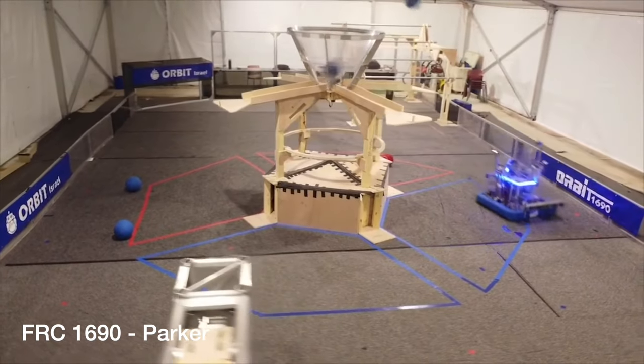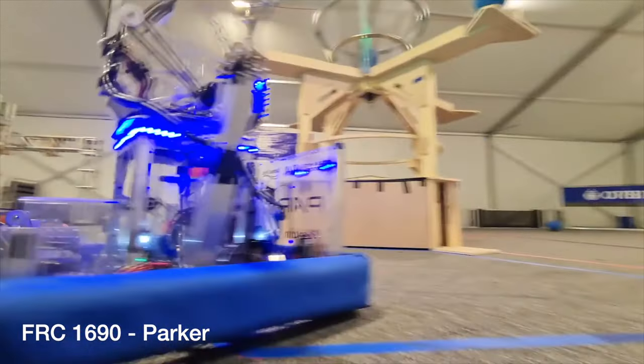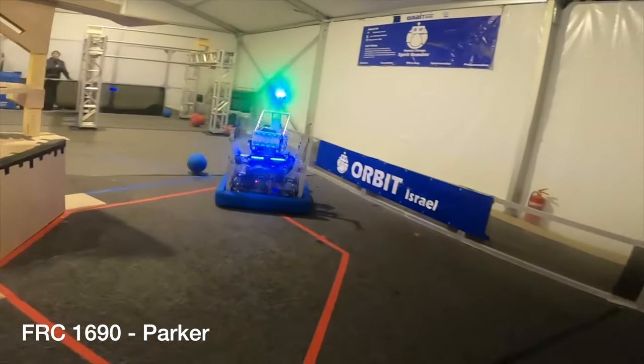An omnidirectional drivetrain is one where the number of drive control axes is equal to the number of available control axes. In our case, that's 3. My robotics background comes mostly from FIRST Robotics, where omnidirectional drivetrains are actually somewhat common. The particular advantages there lie in more fluid alignment for placing a target or shooting at a target. But in 2019, a team undeniably demonstrated to me the application for this type of drivetrain in defense avoidance. Robots can't attack each other in FIRST competitions, but blocking or pushing is permitted.